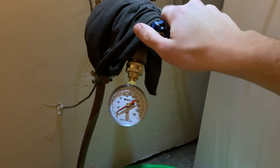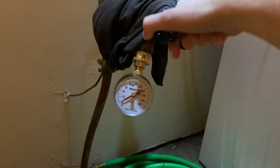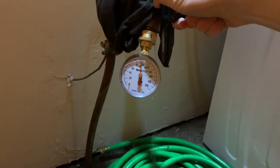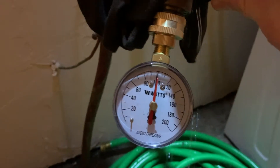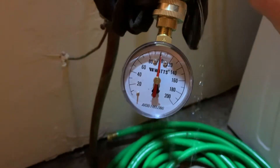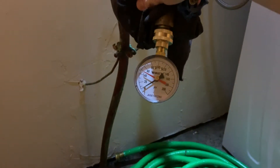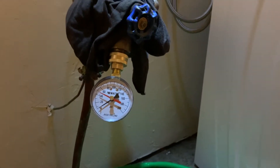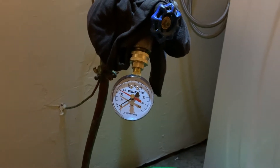I have this installed and I just have a towel here because this connection leaks — I haven't gotten around to replacing it yet. We're gonna turn on here, and that's not even all the way open. You can see we're sitting right at 100 PSI, so that is a lot. Normal for a house would be like 45 or 50. Now we know — I'm in Kansas City, Missouri, have KC Water — so we know that they're giving us about a hundred pounds.